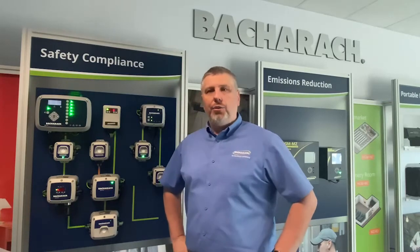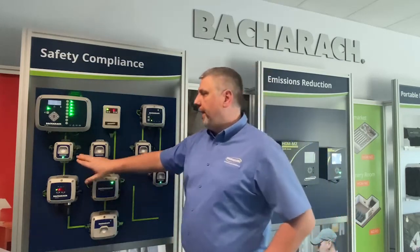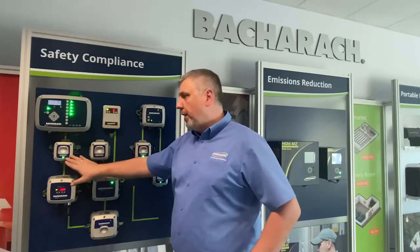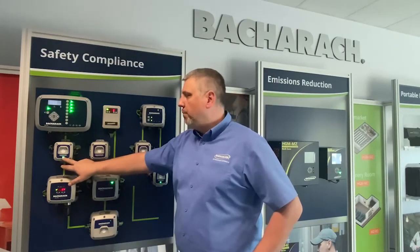This app will allow you to utilise most of the features of the unit — change the alarm set points, change all the unit's properties, and interrogate the unit in case of fault conditions. The MGS 410 is the base unit, with the ability to communicate using audiovisual signals and Modbus, but no additional features beyond that.